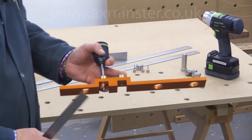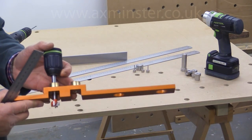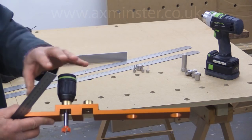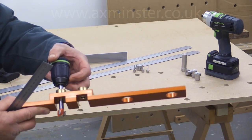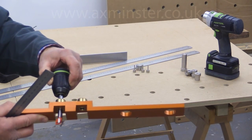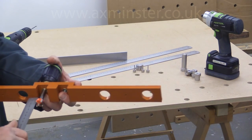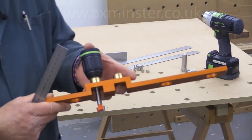I've been asked several times how deep you can cut with the 20mm cutter once it's in the 20mm guide block. So what I've done is I've positioned my cutter in this chuck at what I consider to be a pretty normal depth. Letting that rest on top of the bronze bushing leaves me with a cut depth of 34mm.